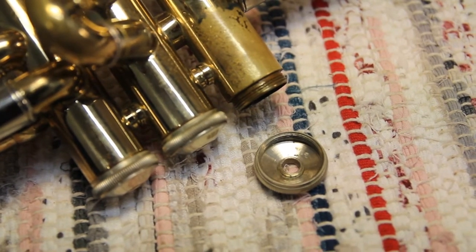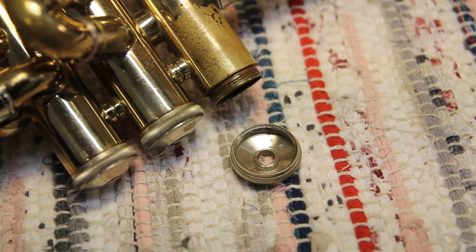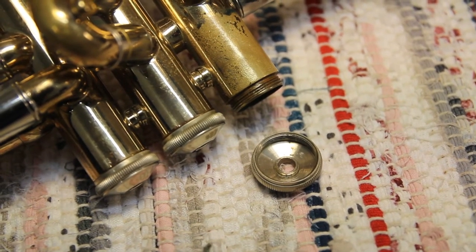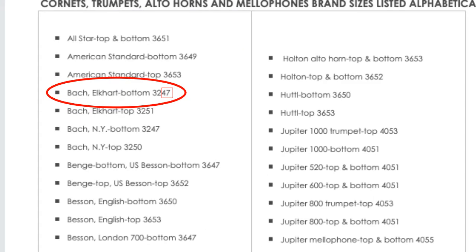First, you need to find out the correct measures. You can, of course, measure the instrument in question, but luckily, various tool manufacturers keep data at their website. Here I can find that the diameter is 47/64 of an inch, and the threading is 32 threads per inch.